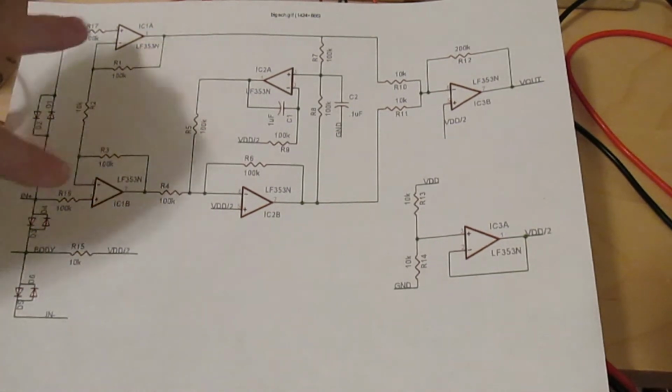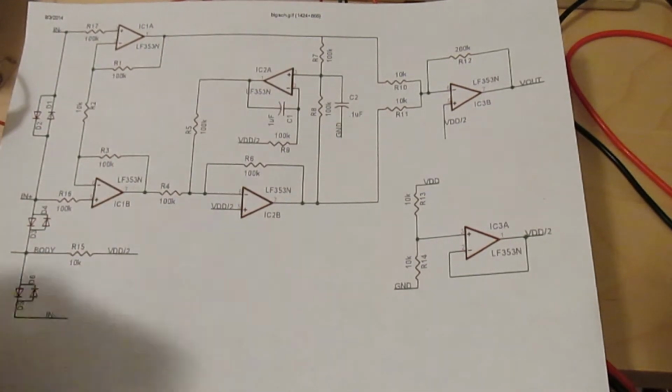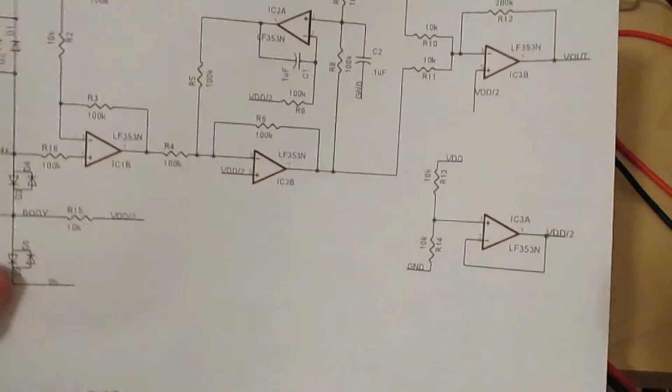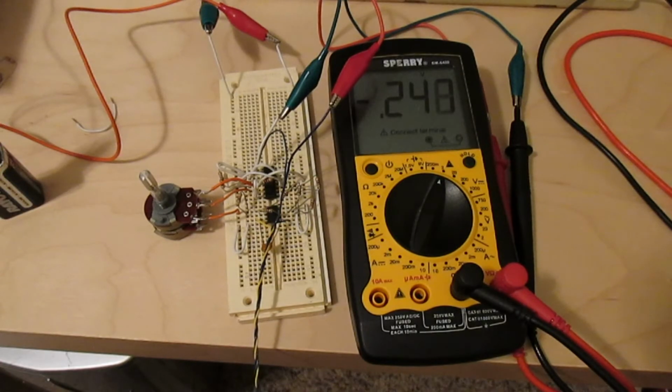So I'm going to lower my front end gain and switch my offset correction loop, put it in between the front end and back end. Basically make my circuit more like Jason's for the next video. So there you have it, more DC offset problems with my circuit, but next time I should have that fixed, and then I can move on to solving the noise problem.